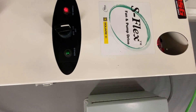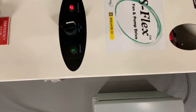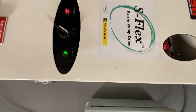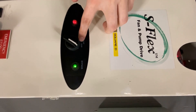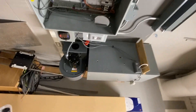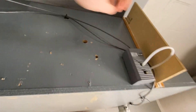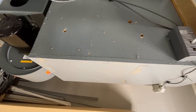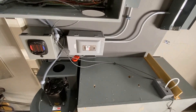When I go into bypass mode it will not be using this VFD and it will just be running straight off the line power, no matter if I change the blockage or not. You can see I got my bypass light on there letting me know that I'm in bypass mode. I can release the blockage here and close it all the way up and the motor is going to stay at the same speed. And that is how a VFD works with a motor.